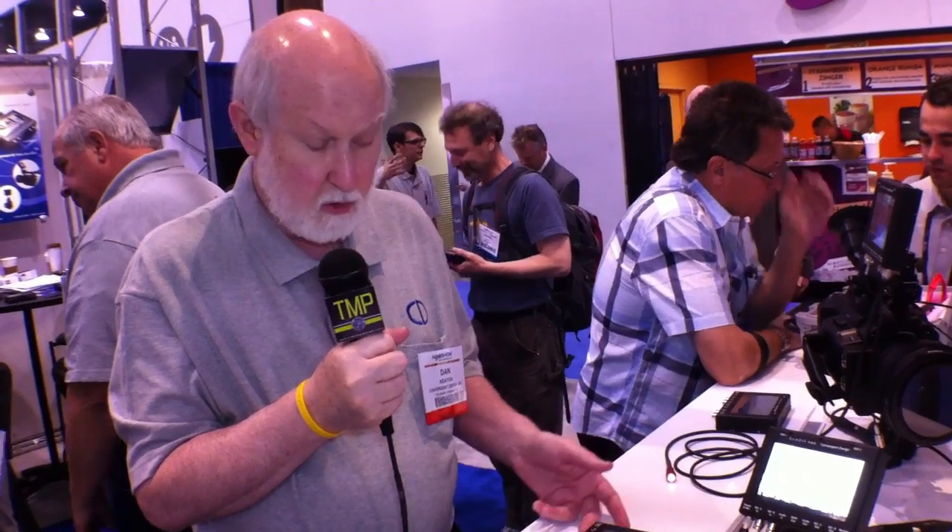Powering is via a 4-pin Hirose. We provide numerous cables — the cables that work with the nano flash work with this. It comes with a 4-pin XLR for professional power to our 4-pin Hirose, and the voltage input is around 5 to 19.5 volts. If you're using a Sony F3, there's a battery that plugs in the back with a connector for both the nano flash and the F3. Because the camera draws 24 watts and we draw typically 12 watts, totaling about 36 watts, you won't get hours of record time on that small battery.